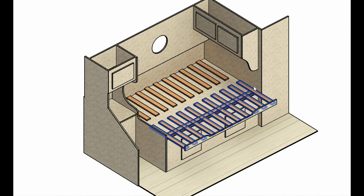On these drawer runners on the side here. The drawer runners are there for two things. One, to make it easier to slide, and two, to give some support across the front here, because obviously when we put weight on this edge here, it's going to want to tip up. So I'm hoping that the drawer runners, I've got some heavy duty ones that will take a lot of weight, will actually hold this, and this front piece along here will be deep enough. If I have to make this a bit deeper, I can go down as far as I want to, as long as it doesn't interfere with the cupboard doors there.